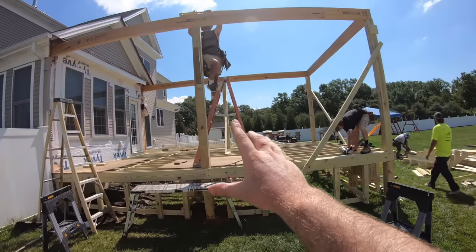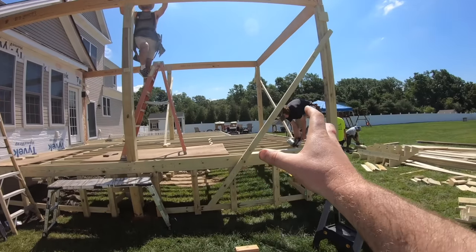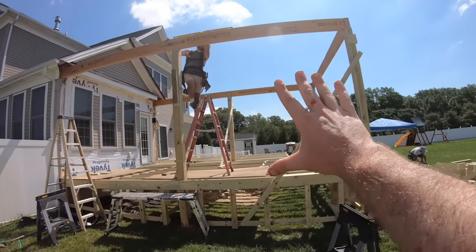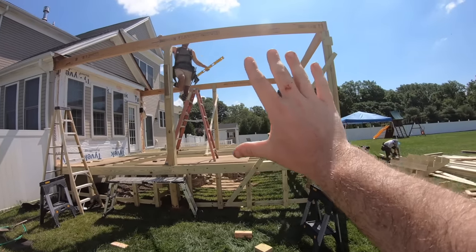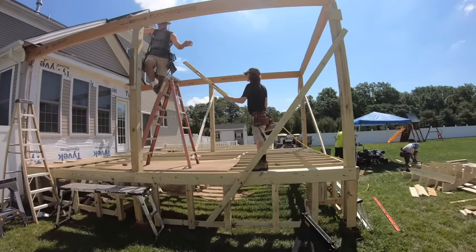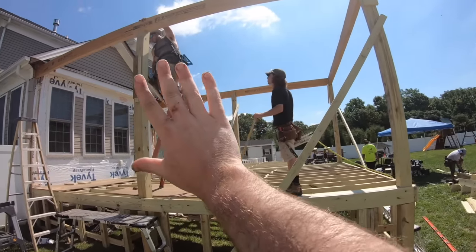They're going down to helical piles. So that's all supported. Now we're doing some 6x6s in between, and that's really just to frame out our windows because we're gonna have storm windows here. So I'm gonna put those in. They're not really supporting the roof. They're just there as our nailers because we're gonna trim around them, and then the windows will just pop right in.